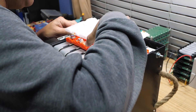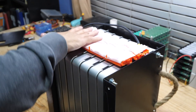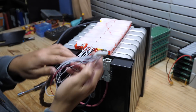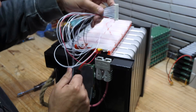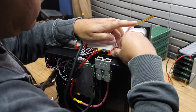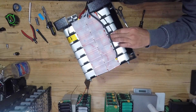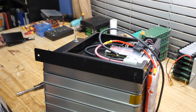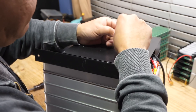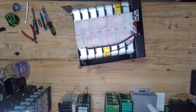Now we just have to cover it — just cut in here. It's kind of beat up there, but the last thing you'd have to do is connect the cable into the BMS. There are two thermistors — you get some Kapton tape, run one in this battery here, and then the other one I can run it over here. Kind of a mess in there, but not to worry because — look at this — we have a cover for that. And there you go; there should be power there if the MOSFETs are on.